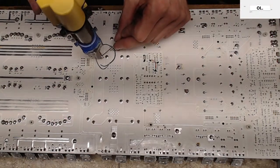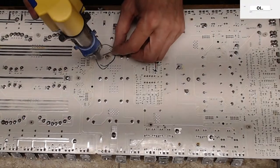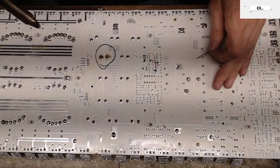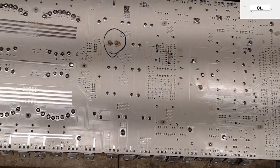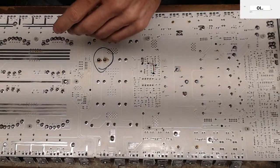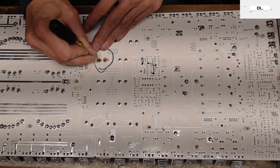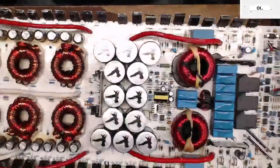So what I'm going to do is take some good solder and put it on the old nasty lead free solder. Oh, the good old FR301 does it again. Oh, and that capacitor just has to be wedged in there, doesn't it? I will use a small screwdriver just to make sure that the leads are not soldered into the via, which it is nice and free. So now I just got to get the capacitor out of there. Hope I desoldered the right one. Pretty sure I did.